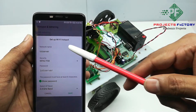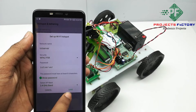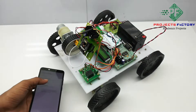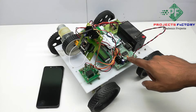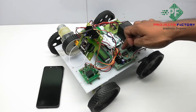We can see here the network name 'iot server' and password 'iot server'. Save. Now power on the device. Here we are using a 12 volts 1 amp battery to connect it to the Arduino controller.